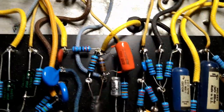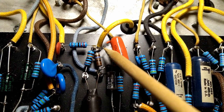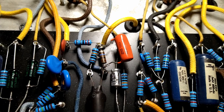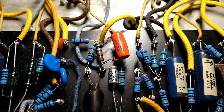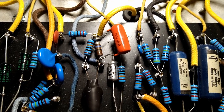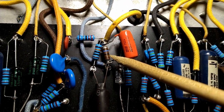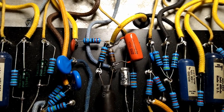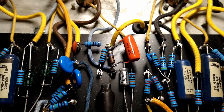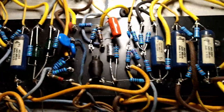All right, there's our little capacitor. That'll hopefully take care of the little bit of ticking we had in the tremolo. It wasn't bad. And, of course, I always have the amp on 10, so if it was on a more reasonable volume, you probably wouldn't even hear it. Especially when you're playing, you didn't even notice it. But we wanted it to be as good as it could be, right? So there's that, and I topped up some of the turret tops, tried to make it a little prettier.